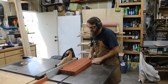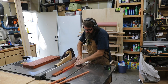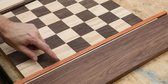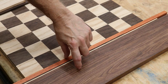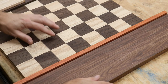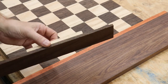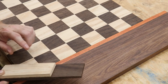Now I need a few pieces of padauk to make the trim. After some careful measuring, those pieces are cut. I'm trying to figure out the border — my initial idea was to do padauk, then tie in the wenge and ash with little accent strips, and then a piece of pau ferro about an inch and a quarter, giving me a two-inch wide border. But looking at it now, I think it's a little too busy. So I'll get rid of the little strips and just do padauk and pau ferro. I also like the idea of using the leftover wenge and ash to laminate some little feet to raise the whole board off the table.